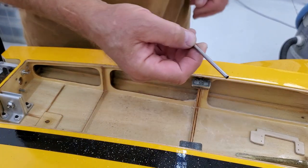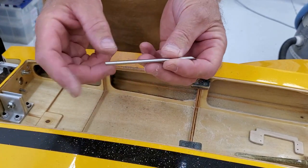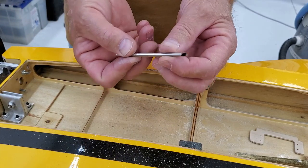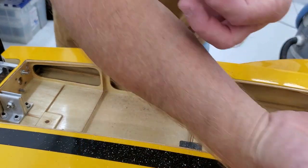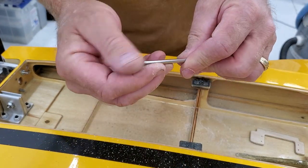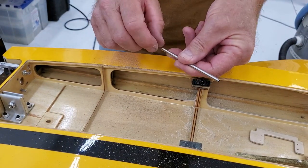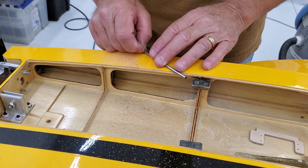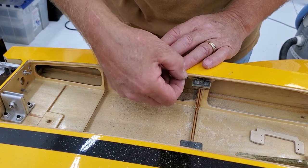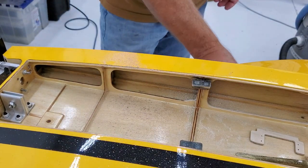We're adding a water outlet — it's just another piece of that 0.165-inch outside diameter hypodermic needle tubing. You'll see why it's got this cool little sausage cut. It goes through the hole further forward, and this sausage cut here will line up perfectly with the exterior of the hole, so it has just a really cool look on the outside, and the water line hits it up underneath the hole about like that. So that's how we're going to do that.